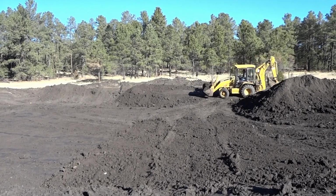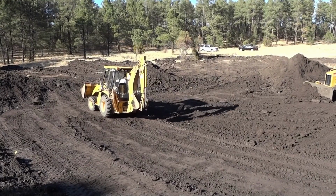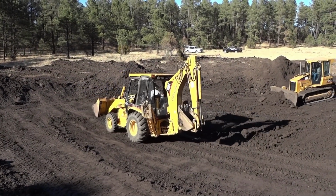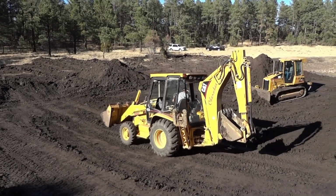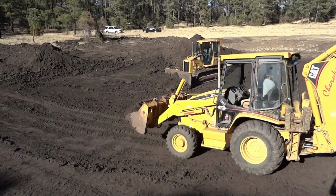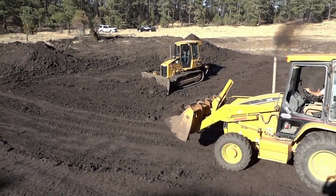He then levels the soil so there are no ridges, making it easier to compact. The backhoe operator compacts the clay layer by traveling over it many times. The operator moves the machine from left to right and then from right to left to compact even the ridges between the tire ruts. The backhoe carries around the front bucket filled with soil for extra weight to aid with compaction.